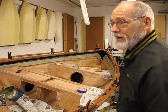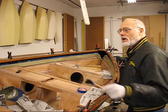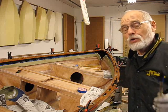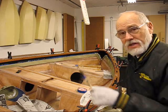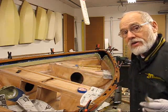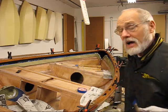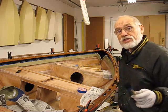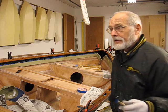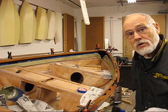Okay, I always start out by making certain I've got the first coat done, and I put in a pretty good amount. Well, not too much that it ruins the epoxy mix, but then this isn't structural, this is visual. So the load of black pigment is a little higher than I may use, but not that high. I may be able to get away with a single coat, I'm hoping, and then I'll take a look tomorrow after it's cured to see whether or not I can go ahead and pull the tape off at that time. If not, then I'll mix up another coat.